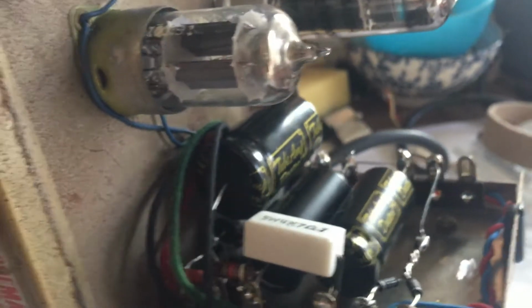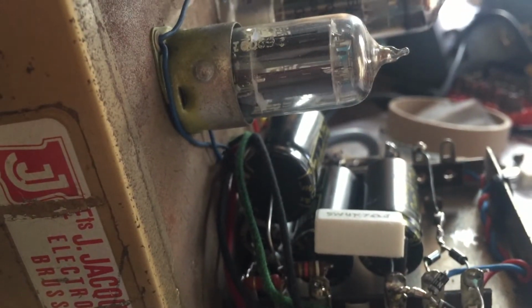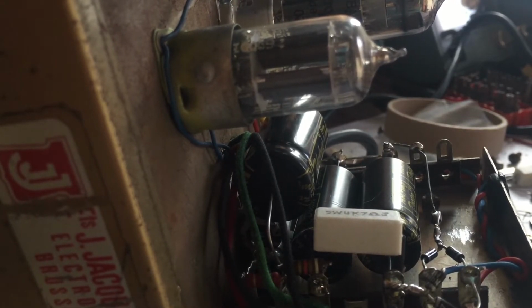Maybe this is the perfect angle on the power section. This may even still be better. Yep. I don't care if things explode, but I do want to have it on film. If things explode, that would be spectacular. I just connected up the speaker and I'm just gonna turn it on. The power section should be okay, but you never know. I'm gonna check the tubes for filament glow, and if nothing happens and we get no sound at all, then you may have to turn it off again.